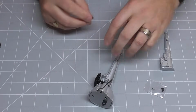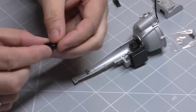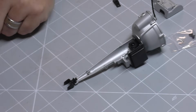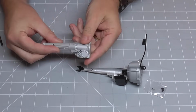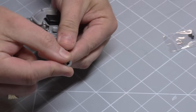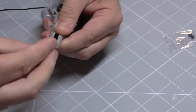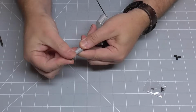Then I've got a slip yoke looking like this, kind of like a universal joint, which is just going to be sitting into that section there like that, which means I can then put the other side of the transmission over the top here. Again, all metal, making sure this is all encased together. It'd be best to actually put it together first and then pry open the end. I think this is the easiest way to get this yoke in. So then that can go in like that. This should be able to turn, as you can see there.